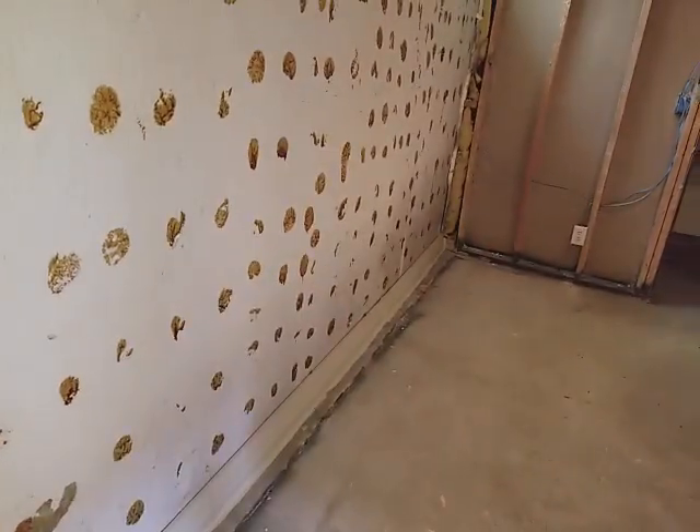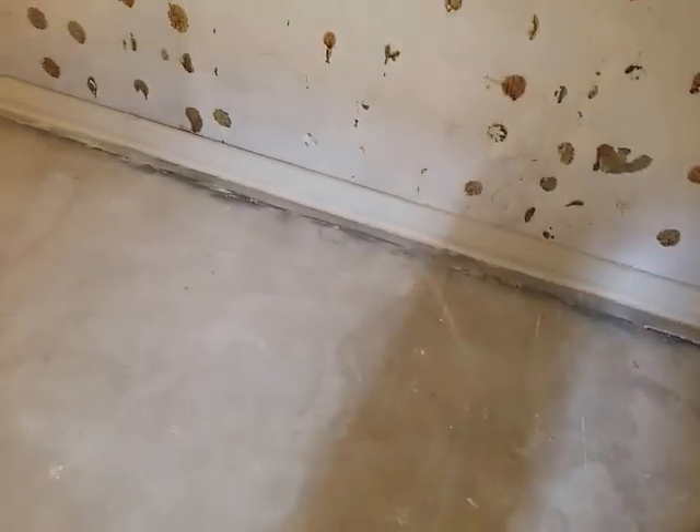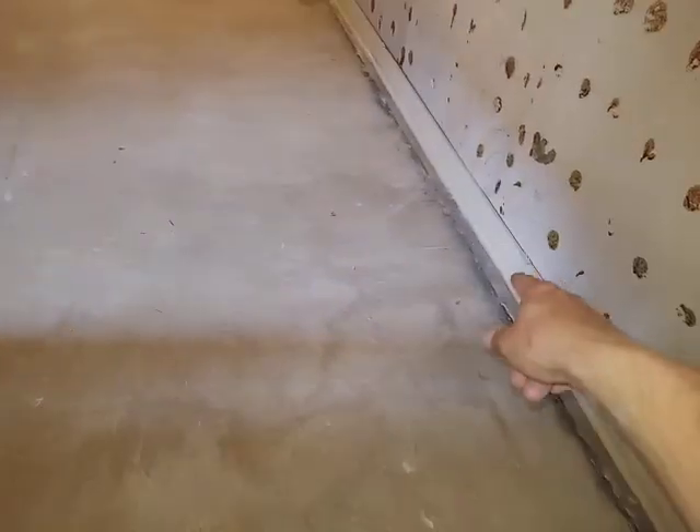The glue is not going to come off — your best bet is to get some good cement paint, masonry paint with primer, so those don't bleed through. I would even recommend tinting it — even if you do our upstairs bathroom wall color, tint it down here. This floor — you have to call Bill on that — it's never been painted. Most likely we're going to leave it bare so that if it does leak we do not have to repaint the floor. If it does leak while you guys are here, just let me know. It rained the last couple of days since I put this down and I have not had any water — this is where it normally comes in, all along there where that wall is trash on the outside, but it's been good.